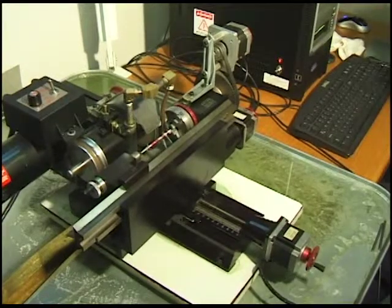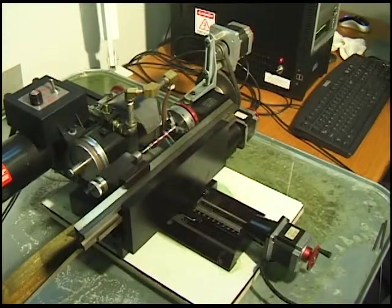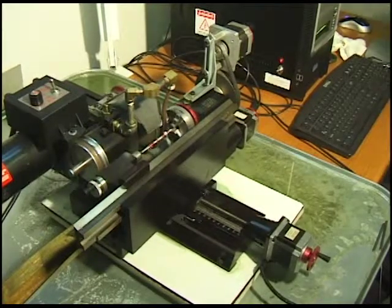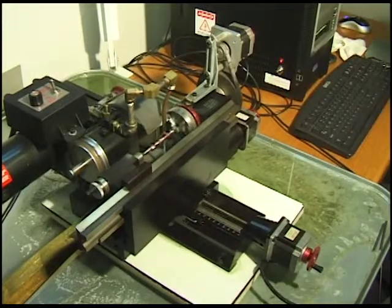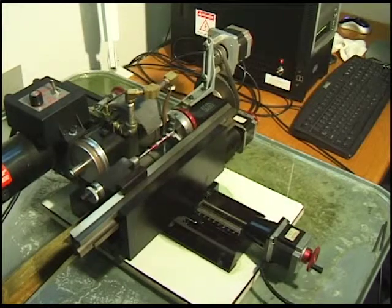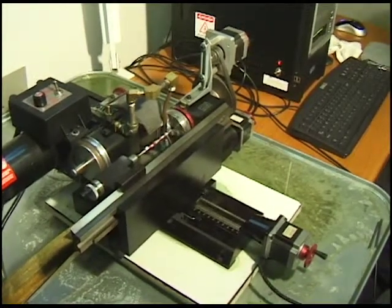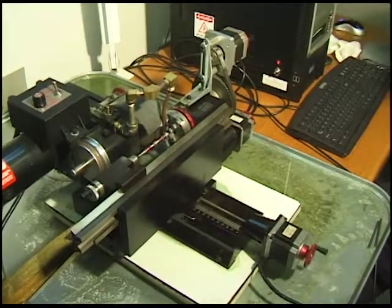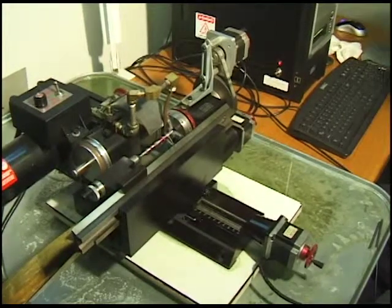In other words, you put the angle in and the lift. The program itself will fill in a curved line because of the algorithm — it won't be a series of flat points if you do it that way. But if you do it at about every one or two degrees, it'll generate a nicely shaped cam.